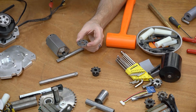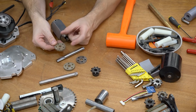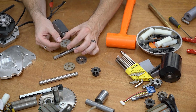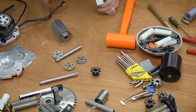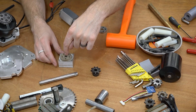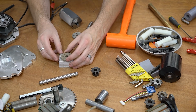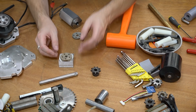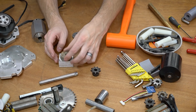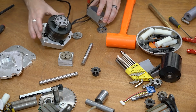For the flanges, I reached out to Rocky Mountain Water Jets and had them cut the blanks. The inside diameter was slightly smaller than needed for the broach, and the outside diameter was slightly larger than needed for the bearing. So I made this simple aluminum jig block — it screws down to the blank so we can open up the ID and clean up the OD for the bearing fit. Water jet has pretty close tolerances but it's never good enough for a bearing fit or something we're going to broach. Instead of drilling and turning individually, this little jig made it go a lot quicker. Then it was just a matter of broaching and putting it all together.